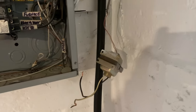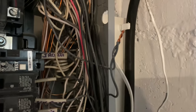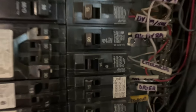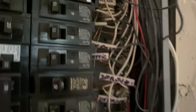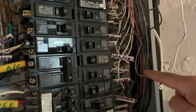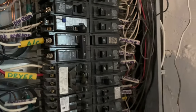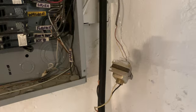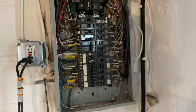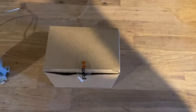Now I have the transformer disconnected. I have the black wire exposed with the breaker off — 15 amp disconnect to the neutral. There is a manifold where all the common wires go into. Now I have to go upstairs, get the new transformer, remount it to the hole, connect it, and close the panel.